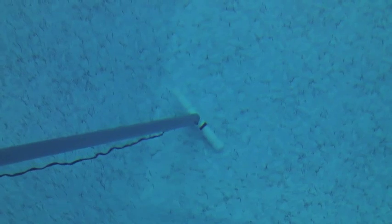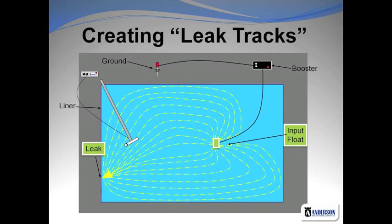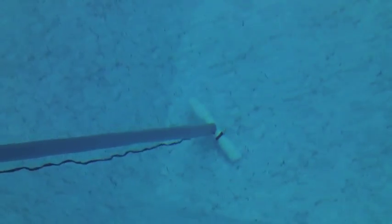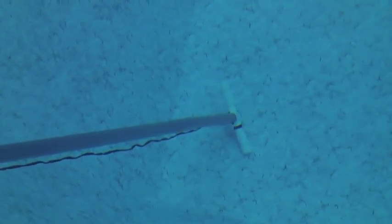That's the point of the leak. No matter if we were to pass by this, the clicking stops — our electricity is no longer moving towards the leak as far as the probe is concerned. There's our problem. Time to go down and confirm that with a dye test.